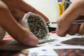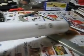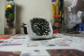And there you go. Ballast harvest. Here are the wires that would connect to the bulb. Now you can actually run a full-sized linear fluorescent bulb with this. I've done it before with a brand new bulb, which I've also dissected. If you want to test this, you could hook it up to a 20-watt fluorescent bulb.